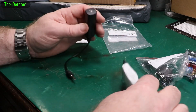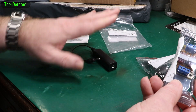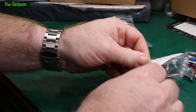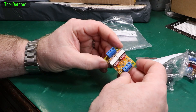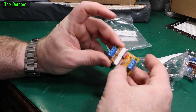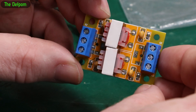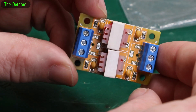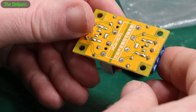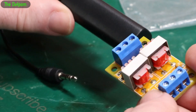It's just a ground loop issue. So I've got different types. I've got one of these — I've already put one on my computer and I know it works, it works quite well. And also these type, which are obviously for wiring into equipment or into a little project box. Very similar setup. Obviously these are stereo ones, so there are two transformers. Got some capacitors on there as well, which will help quiet it down a bit more. And this one is obviously meant to go inside a piece of equipment — basically the equivalent of the plug-in version. They do the same thing.